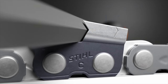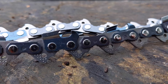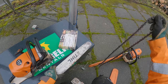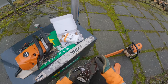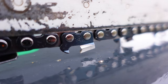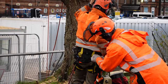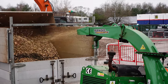In terms of sharpening, there are two ends of the spectrum. If you're an experienced logger used to a round file, that is an art — it takes a good while to get to a point where you and your crew are happy with how you sharpen the saw. You'll find it strange going to a Hexa file because you can't manipulate the edge — whether you want more gullet, a deeper cut, or a pointer edge. You just put the file into the gullet and that's it; it slots into that groove like a C shape. On the other end, if you're new to it, you can easily get a very sharp edge by just throwing the file in and going.